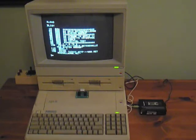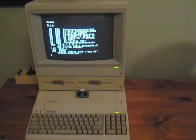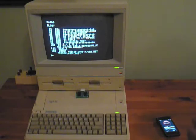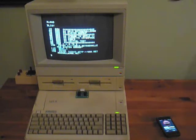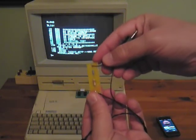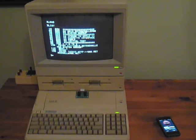Now I'll get rid of the tape. Here's an iPhone running an app called iTalk. Here's the cable I created — the iPhone end and the Apple II end. This required 1600 ohms on the mic line, otherwise the iPhone wouldn't treat it as a microphone.